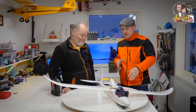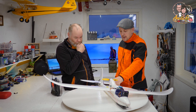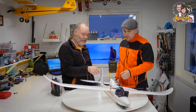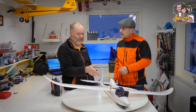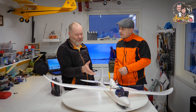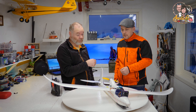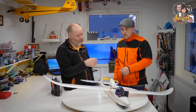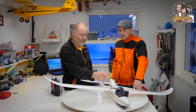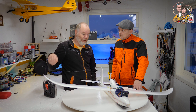You have done some modification on this plane — you have cut a piece of the tail because you needed to use a larger prop. We're going to show you a closer look later. It's supposed to use a six-inch prop, and I had a six-inch speed prop 6x6, but it had very bad efficiency. So I put a multi-rotor 7x4.5 and it works perfectly — very low amperage for a nice speed. And a little tip: this black spot is just some pieces of electrical tape, which is a very nice way of balancing the prop.